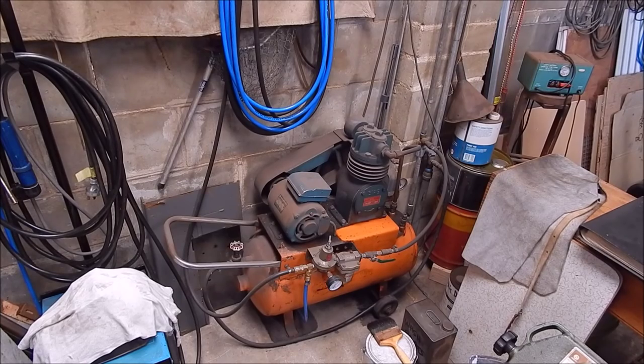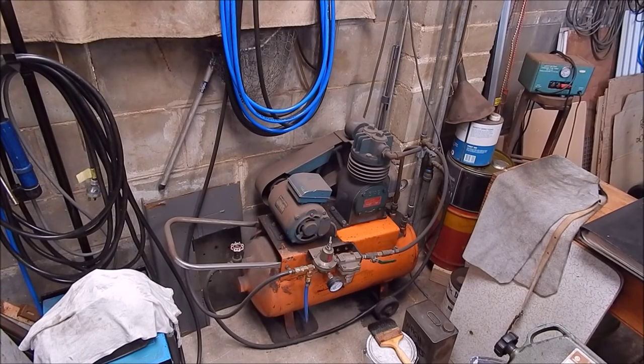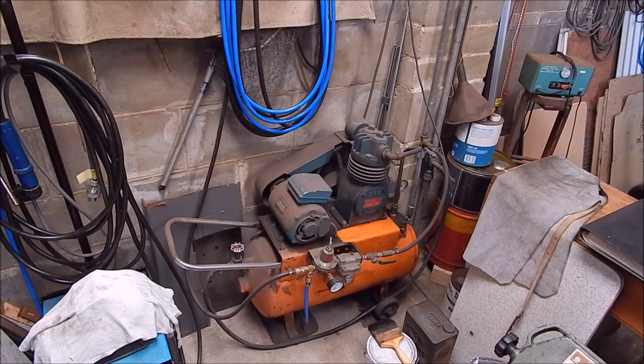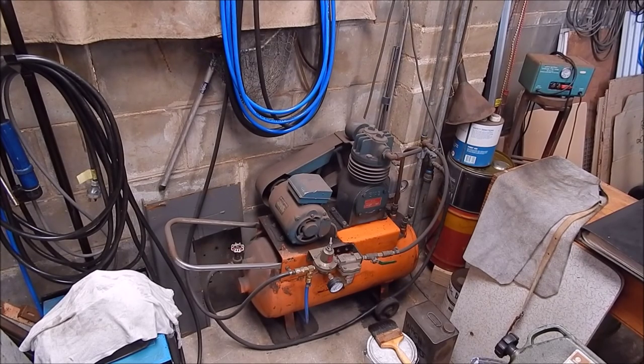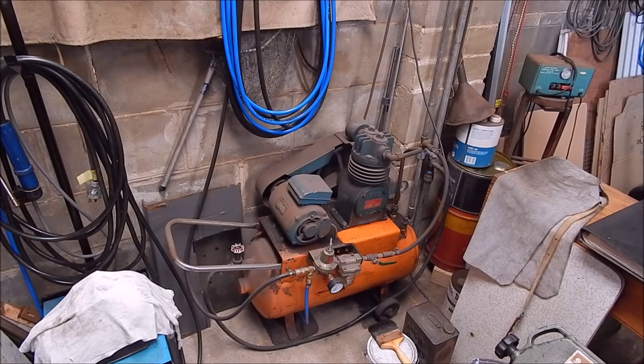You'll obviously need compressed air, and whether you've got a wet sump compressor or an oilless compressor, you'll still have to run the air through a water trap of some sort — water traps also take out oil vapour. Make sure the air is dry and free of contaminants, and your air tools will run a long time with no problem. In my earlier videos I show how you can make an intercooler for an air compressor — put it between the tank and the water trap and that will get your water trap working correctly, ensuring the continued life of your air tools.